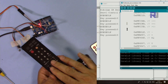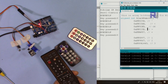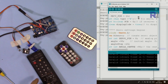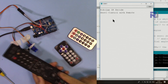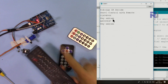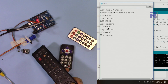Now I'm going to capture the IR codes for a home remote and use it to control the servo instead of these remotes. I'll use the black remote setting — B for black, PCB equal 0 since this is not the PCB module. I set display code equal true so when I press keys it will also display the code. My plan is to use the right arrow to move right, left arrow to move left, and enter to reset. First I need to capture the codes. Pressing right shows 'unknown', which means none of the predefined keys matched — that's good. Pressing left also shows 'unknown' but we are getting the code.